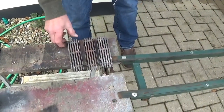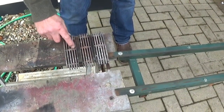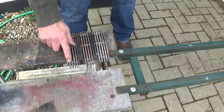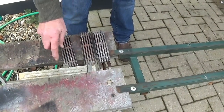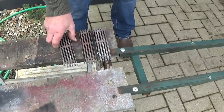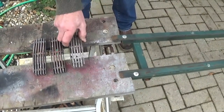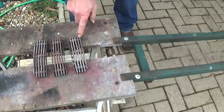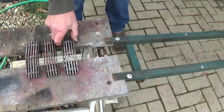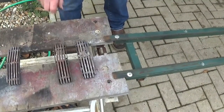The fire grate is in three sections which go in through the fire hole door. The centre part is nearer the back of the engine, so the longer slope goes towards the front. The cutout pieces are to miss the flanging in the firebox — the right hand piece, the centre piece is plain, and the left hand piece has the cutouts on the left hand side. When you put them in the firebox you put the outside two in first and then drop the middle one in between them.